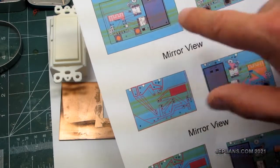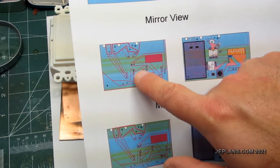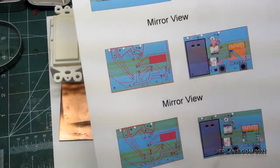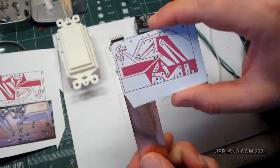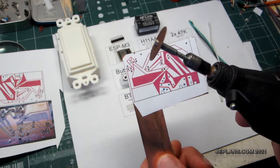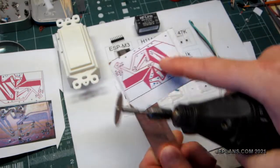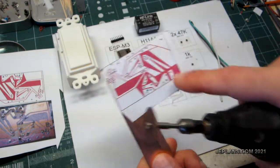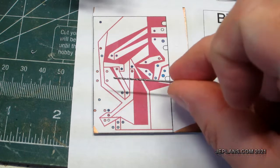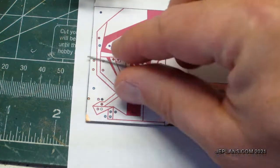This is essentially the top view of the switch from the top of the circuit board. Since we're cutting it out from the bottom side, we need a mirror view. So this is the one I'm going to use to put on my PCB — I'll just attach it with a glue stick, stick it right on there, and drill out the holes. I went back and remastered my cutout pattern a bit to fit more of what I'm doing now for cutting out PCBs, using a grinding cutoff wheel. I made more straight lines so I can do them in quick cuts, and filled in spaces that should be removed. Some of these spaces are optional — this will give better antenna coverage, and this is just more gap between the line voltage. To drill out the holes, I got a small drill bit about three sixty-fourths of an inch.